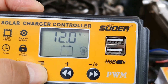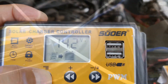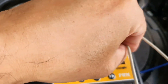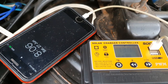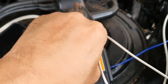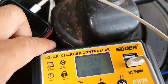It's at 0.1 amps because it's pretty much fully charged, but once I put the load on — I turned off the load connections at the 12-volt connection on the bottom of the PWM — the USB still works. You can see my iPhone kicked up when I plugged it in. I believe both USB connections are at 2 amps — not the fastest, but not the slowest either.